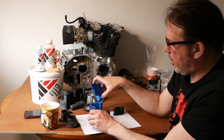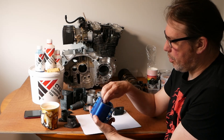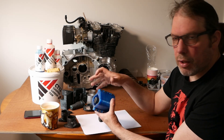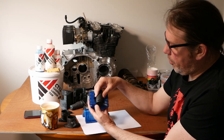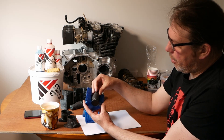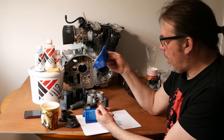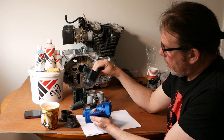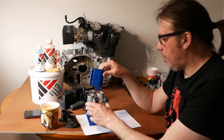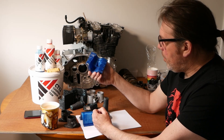There's the core — you can see the way it goes together. You've got all your features in the mould, then the core goes in and the mould closes on it. This core is completely distorted now, but that leaves your cavity, and then the closer just goes on and compresses the whole lot. The core fits in there with a hole through it that aligns with the hole in the main body of the mould for a long threaded rod to go through. If you make the hole off-centre, it can only fit in one direction, which makes things easier. This uses quite a lot less plastic — about 280–300 grams total of 3D printer filament — not as bad as the 500 grams the previous method used. Also only 9 bolts instead of all of those. But it worked really well.